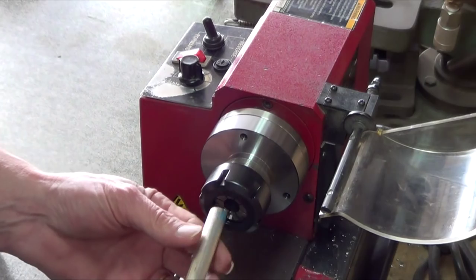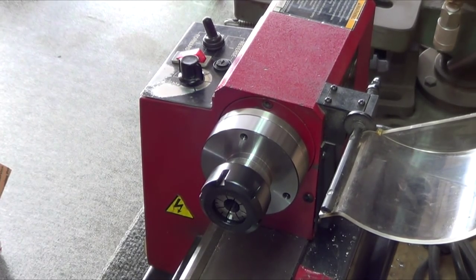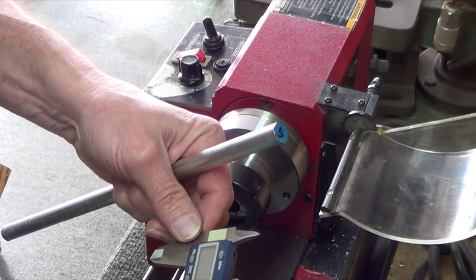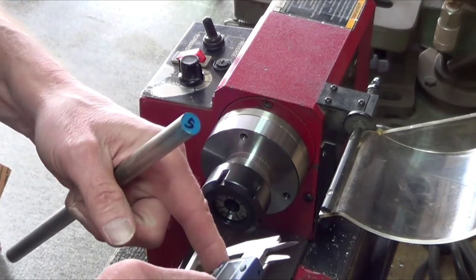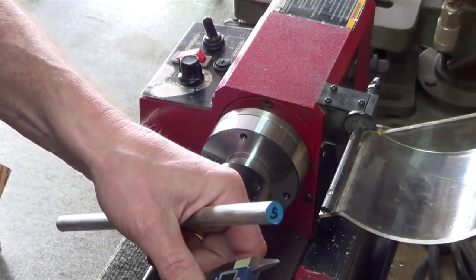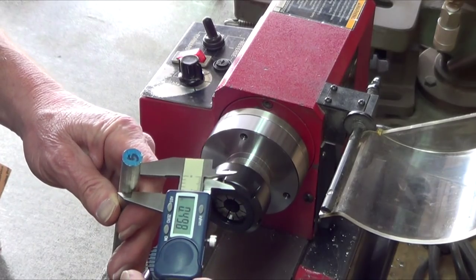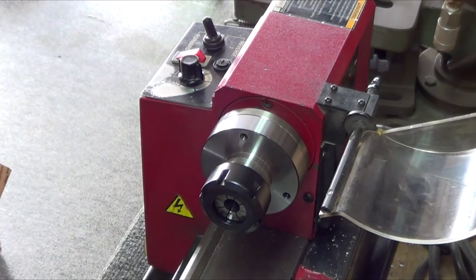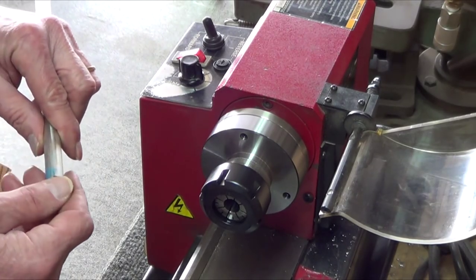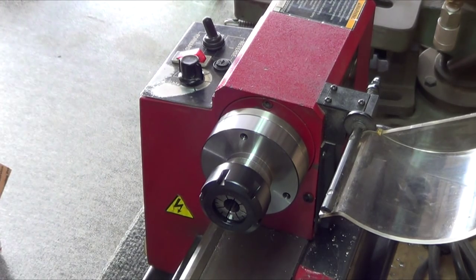Doesn't fit. Great. Why doesn't it fit? This is a half inch piece of aluminum. Caliper. Zero. Clean. And then again, ridiculous. Yeah, 2.5. All right, now I'm reading it. This is 0.498. 497.5. There's no burr on it. Yeah, there is a burr on both ends. That's why. All right, take the burr off.